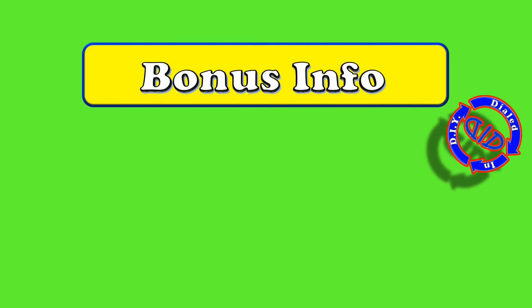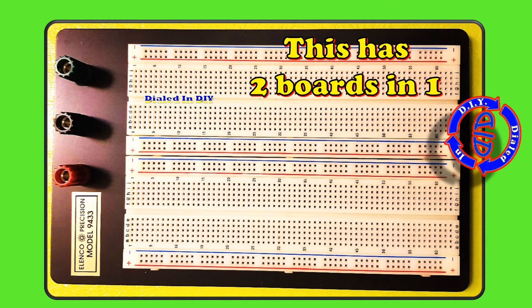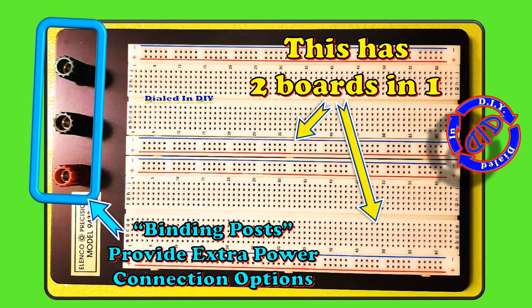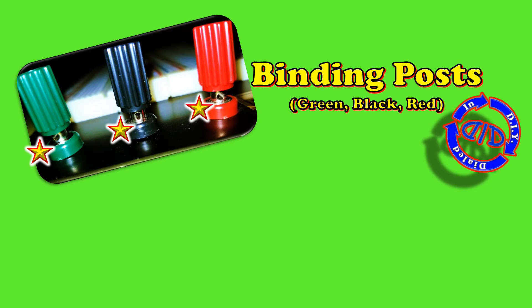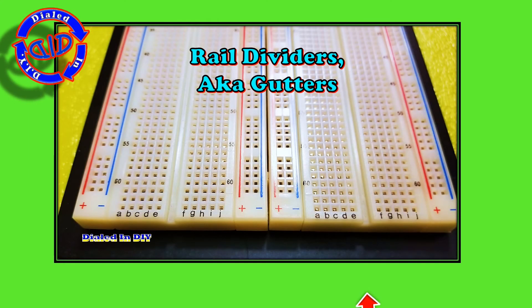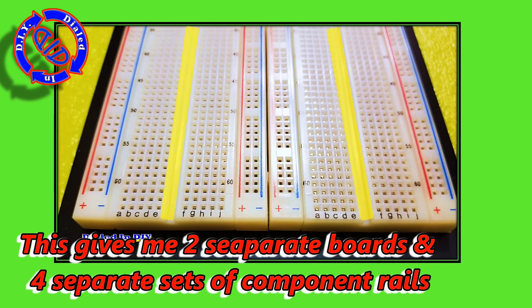Earlier in the video I mentioned that I'd get back to some extra bonus thoughts about breadboards, so let's get back to the full look of my breadboard. It's pretty easy to see that there's some extra stuff here that is not on every basic breadboard. In fact mine has two breadboards in one setup. In addition to that I've got three binding posts which give me a great way to have extra options in connecting my power. It's important to note that these extras are not connected to each other — they work as separate items. The binding posts are ways that I can plug in power directly to a post, tighten it down, and then plug that off into my breadboard. Also, the component rails have little dividers or gutters between the sets of nodes, which allows us to take an integrated circuit and drop it over the middle without having it short out.